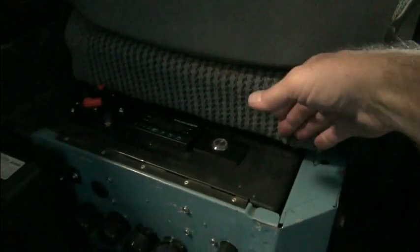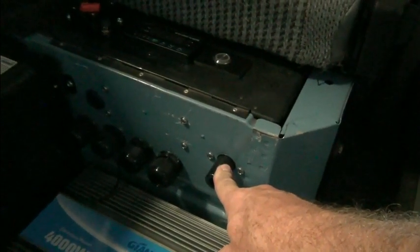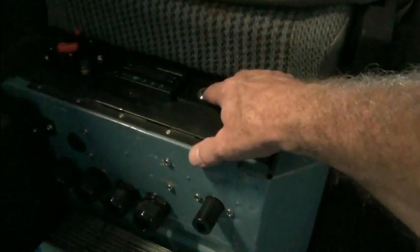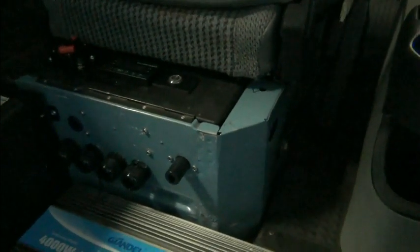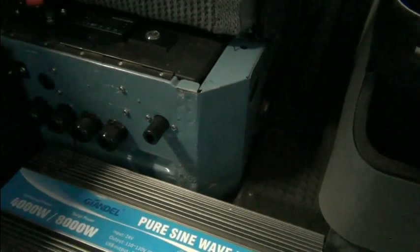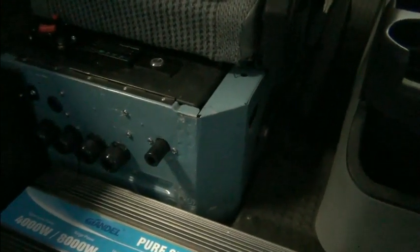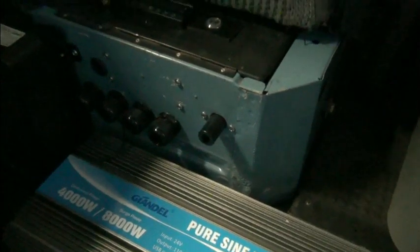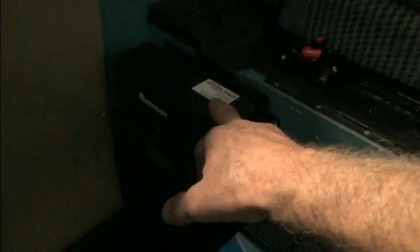So this is the driver's seat all the way back, doesn't go any further back, so we're not interfering with any of those components. We have a grommet there. We've got 4 gland nuts here where our battery cabling will go, and this is a keyed switch right here that will disconnect the battery pack from everything else. So this disconnects 12 volts from the JLD 404. This disconnects the battery pack, the solar battery pack, which will be a 24 volt setup. That's what disconnects it from everything. So we've got a switch that disconnects the power from basically the inverter, and we've got a switch that disconnects the power coming in from the solar array from the charge controller.